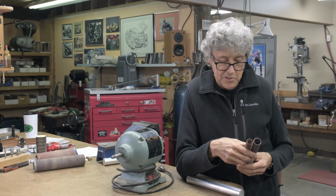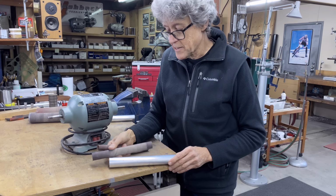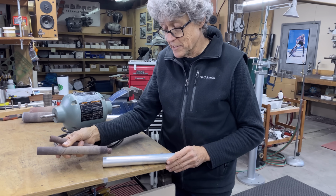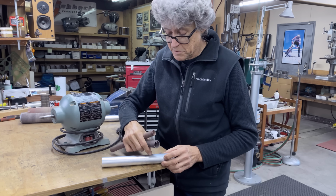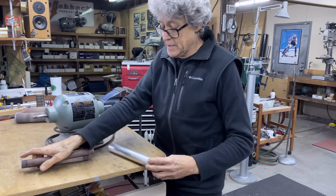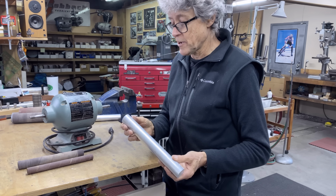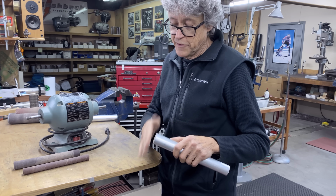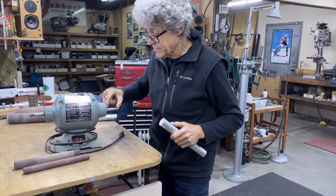That's a gamble. So we'll have to make one of these, and I guess if it's a little too small, you put on a little bit of masking tape, perhaps, maybe just down one side. Then it's flipped around in the mill, gets faced off, and we bore for this size here.